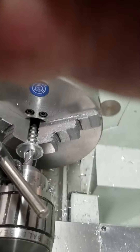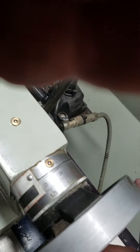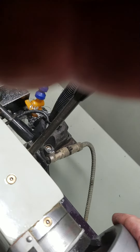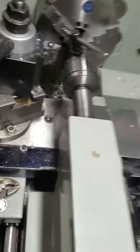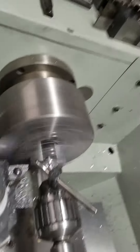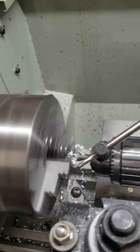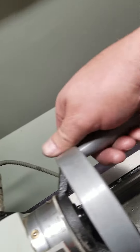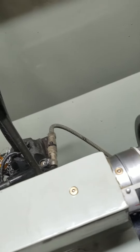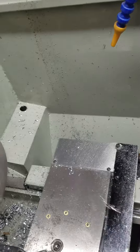The next step is to bring it up here and put the counter bore in it. I take a 1/2 inch end mill, come up, touch the part, come back and bring my part up to zero. Then I lock the tail stock down, turn the lathe back on, and turn in one full revolution — or 1/8 of an inch — then back that off.